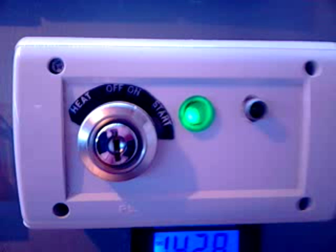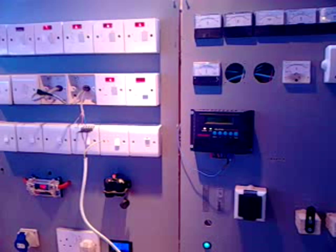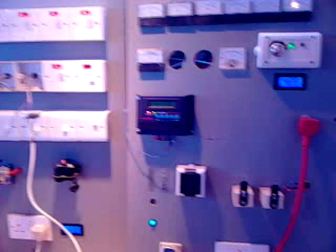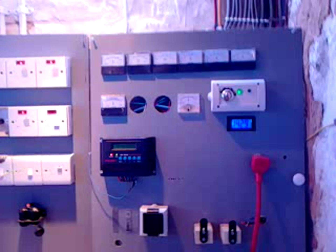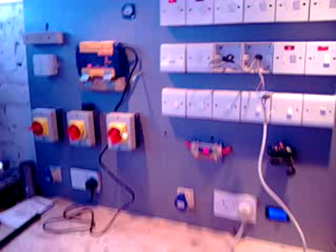I was planning on having a start-stop control system from here, but I can't do it. The engine will not start without the choke, and it won't start with the choke fully on. So if I leave the choke on and just try to start the engine remotely, it will not start. I have to manually operate the choke from the generator. I could probably stop it from here, but I couldn't start it — unless I can get some kind of mechanical lever that moves the choke, but that's too advanced and I don't want to complicate the system.